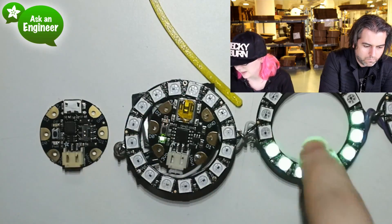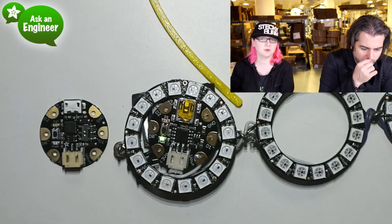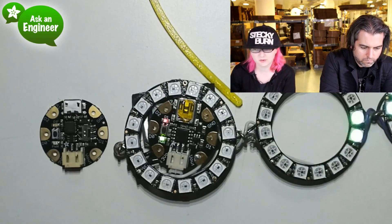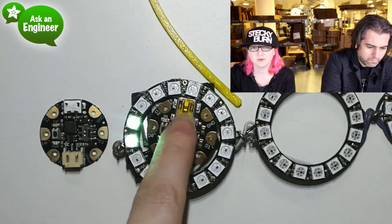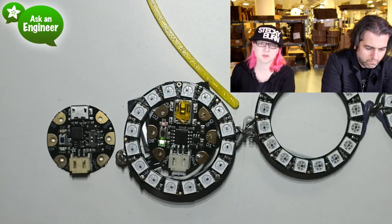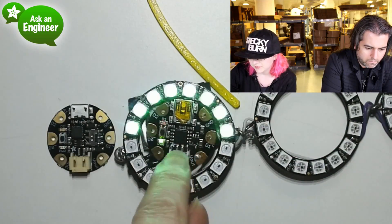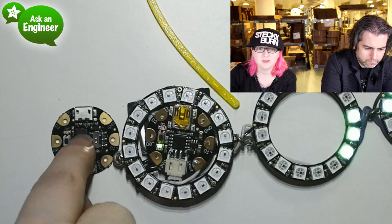There are three pins you can use for input or output — not a lot, but for most people that's fine. They just want a switch, some NeoPixels, and maybe an analog sensor. The update between old and new Gemma is: the old Gemma used a mini-USB connector — a little bit chunkier — and the new one has a micro-USB connector. We're moving to everything being micro-USB because all phones, tablets, gadgets, and GPSs use micro-USB. We also moved from a large SOIC package for the connector controller to a QFN, which makes it much smaller.